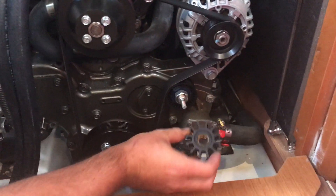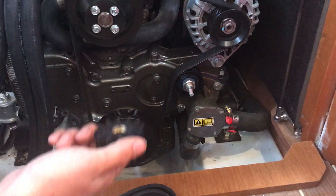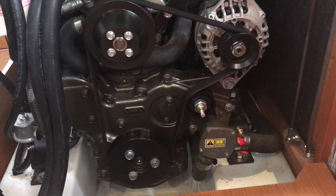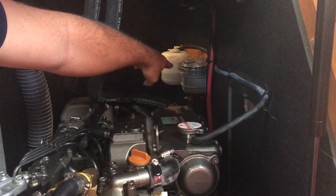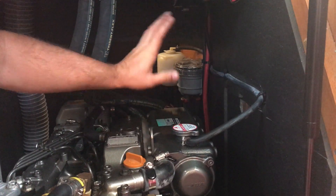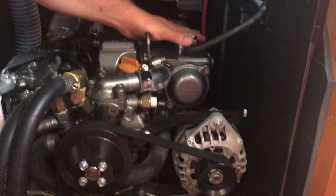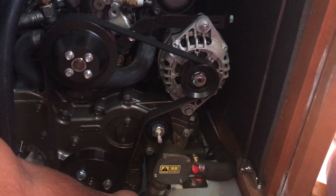What's inside here is an impeller. Sometimes you get debris inside the seacock and it restricts water coming in, and bits and pieces of the impeller will come off. Boats have what's called a sea strainer — that gray plastic with the clear plastic on top. That is the filter for the sea water that comes from the outside and into the water pump right here, coming in through this filter or this hose.